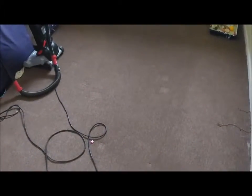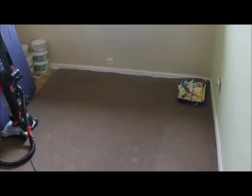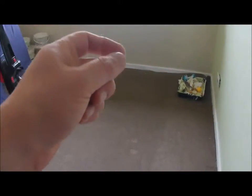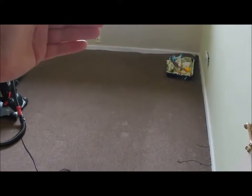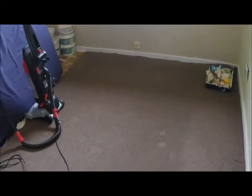This floor of David's, and obviously this is his carpet area. And what we really need to do with this carpet is basically just refit it. Tidy up the edges all the way around. And generally what you do with carpet gripper, for example, I maybe mentioned it earlier in the video, but generally you have carpet gripper about 7mm out from the skirting board. And that gives you sort of the perfect lay for the carpet. If the carpet's a bit thicker, 10mm maybe.